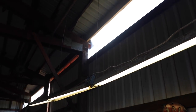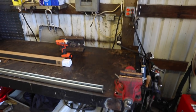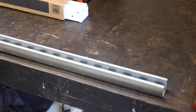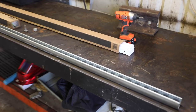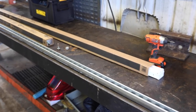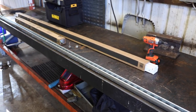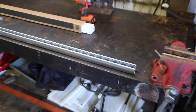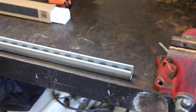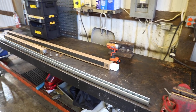You can see here that these lights are being held up by some bailing wire, essentially. I used to be a commercial construction superintendent, so I was fortunate to work around some really great electricians and framers that did things right, and I picked up a few tricks. What we're going to be using today are these LED lights — just Home Depot variety, really a good value. There's one eight-footer and one four-footer that will chain together and hang from this Unistrut. Unistrut is a heavy-duty metal strut. Here's a piece of it — you can hang all sorts of things. They make clips, springs, and attachment points. It's used all the time for plumbers and electricians, and it is the correct way to do it, in combination with all-thread.